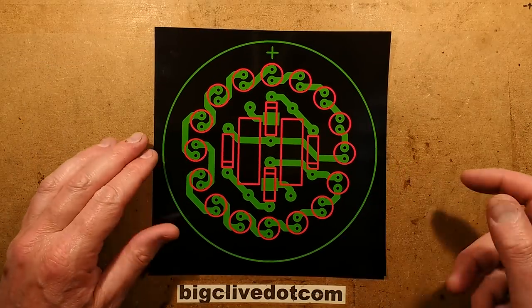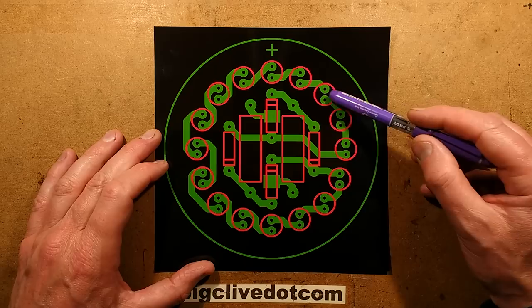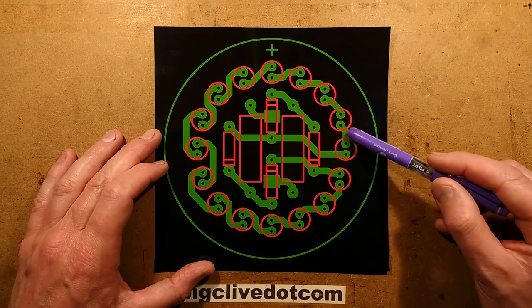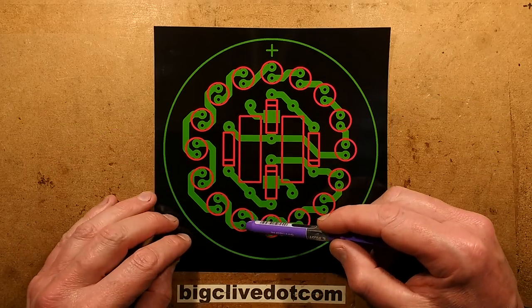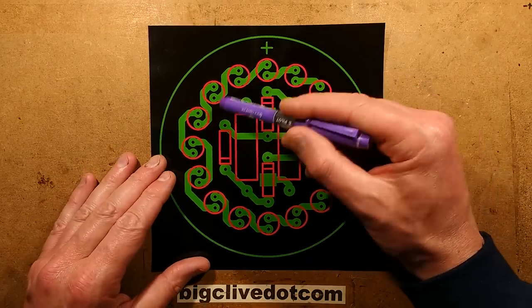Here's the circuit board I came up with. All the LEDs are in series, and because I wanted the polarity to be the same, I arranged the track — you can see it's very simple, it goes positive to negative, positive to negative — and it just follows a nice pattern around. But when it gets to this side of the circle, the bottom connection has to go to the top, so it gets a wee bit messy track-wise, but it still means that the LEDs can go in the same way around.